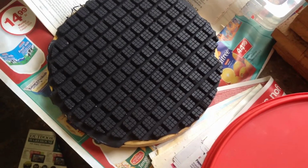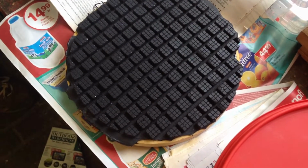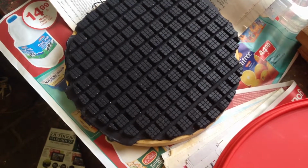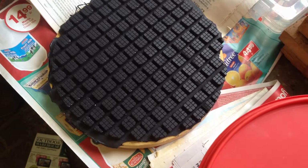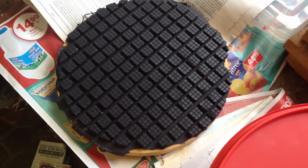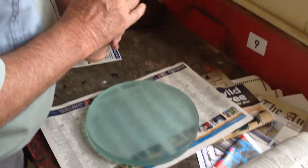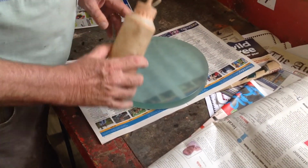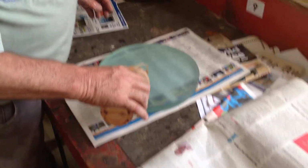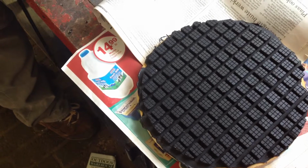All right, folks. So that's the 10-inch mirror with its, oh well, actually a 10-inch tool, the dental stone tool. Our class's very first dental stone tool with pitch on. A few minutes ago you saw the dental stone with tiles on. This one has pitch and will now be pressed onto that mirror to take the right shape. And you actually need some aluminium oxide? This is cerium oxide. Oh, is it cerium? Cerium oxide that we're going to press into the tool to make it polish the mirror.